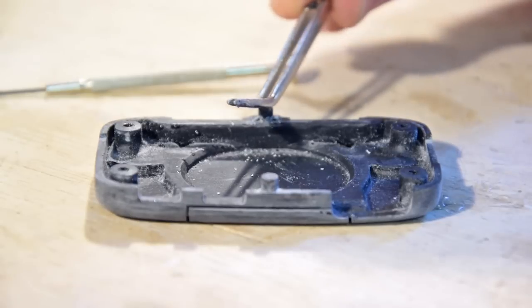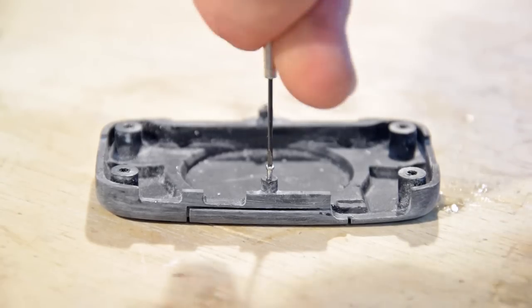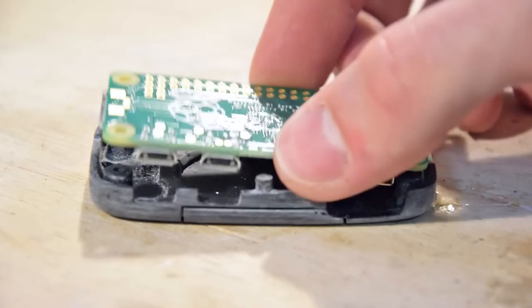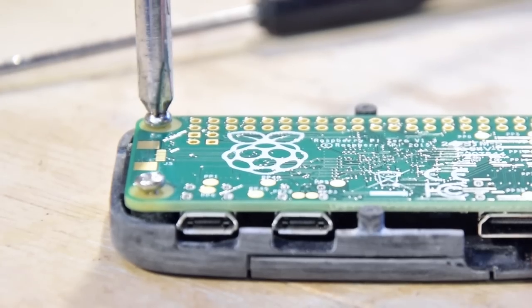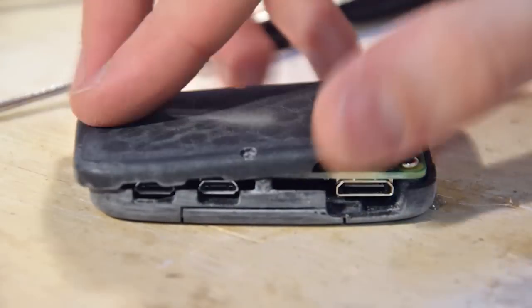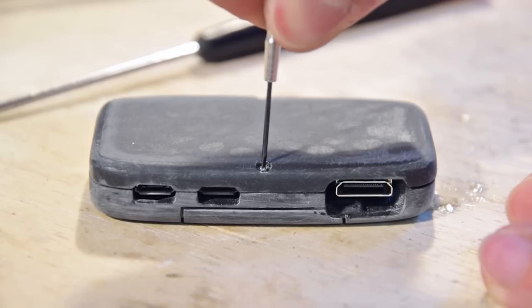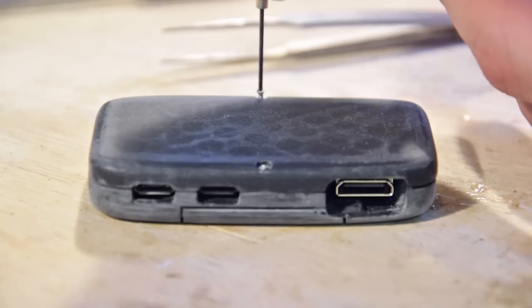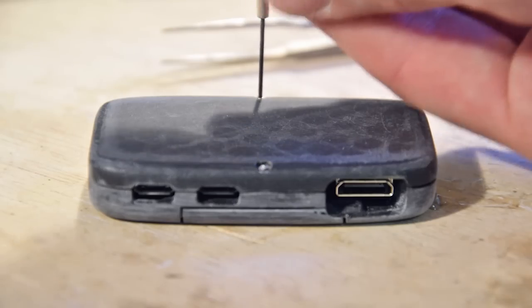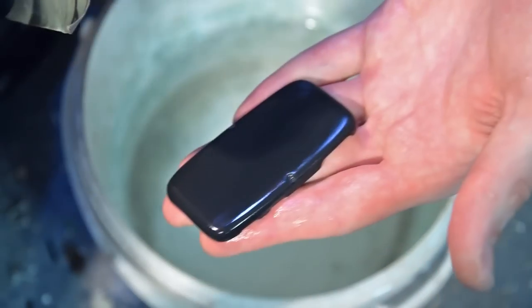As you can see, this test fit is an instant success. The Raspberry Pi Zero fits nicely and the case closes directly — no need to modify the case at all. With this method, we get exactly what we expected from the 3D design. Just before painting, the case is also water-sanded to make the surface as smooth as possible. In this process, the object is sanded with high-grit, water-resistant sandpaper while being dunked in water. The water allows for a much smoother sanding — it's a good idea to do this as a very last step.